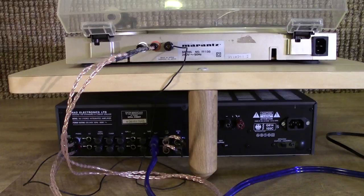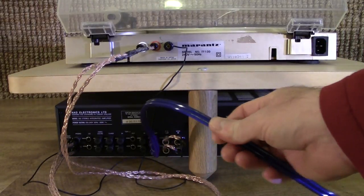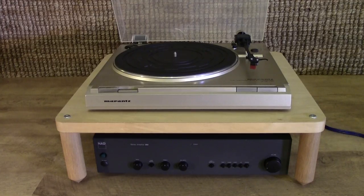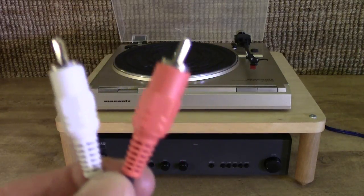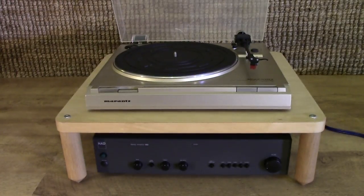If you're using patch leads, you really do need to replace them with some better cable, and it needn't be expensive. This blue cable is pretty cheap — it's nothing special — and it's still significantly better than the cheap patch lead. Here we are at the end of the video. If anything can be learned from it, it's simply that interconnects do matter. If you're using bog-standard RCA-type patch leads, do yourself a favour and replace them with something better. It needn't be something very expensive — it could be something fairly cheap. As long as it's got big, bold, chunky wiring and some shielding, you'll get quite an improvement in sound quality. Never overlook the cabling.